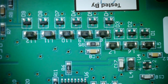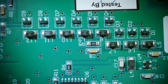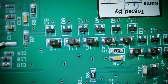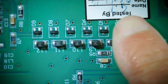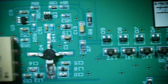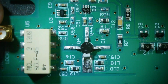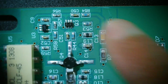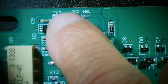Are they using the diodes as some type of capacitor? Are they capacitive voltage diodes? I don't know. Anyway, so whatever signal comes from over here goes through this filter. I'll call it a filter, and then it goes over here to now microwave stuff. It looks like we have an amplifier here. So this comes over to here and goes into this little guy. So he's like the pre-driver or a switch. He might be either a pre-driver or an analog switch.